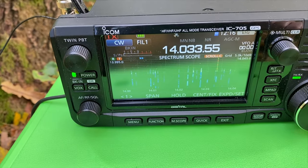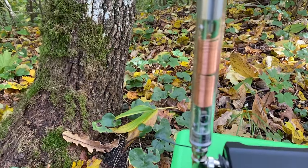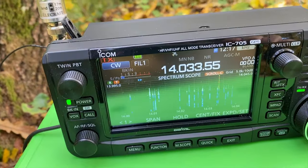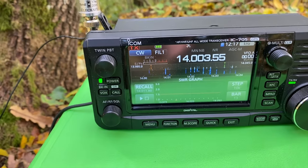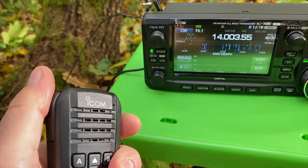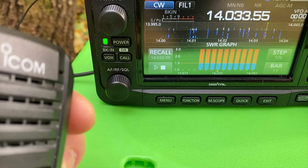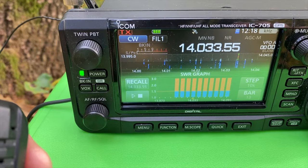But will the antenna work on transmit? In the Elecraft manual it says that on 20 meters this antenna is nearly in resonance. Let's see with the built-in antenna analyzer in the ICOM IC705 what the SWR situation is on 20 meter band. I've switched to antenna analyzer mode, so now I just need to push the PTT and see the SWR graph. Oh yeah — we see that the SWR is three or more than three. That's totally unacceptable.